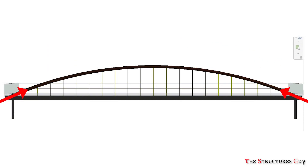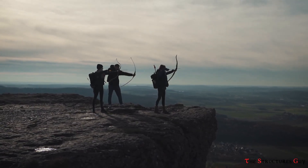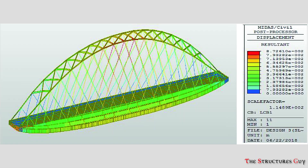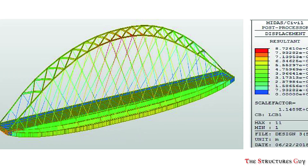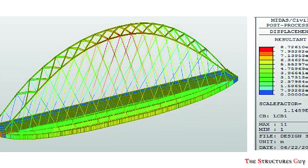The loading causes thrust in the arch, which is balanced by tension in the tie beam spanning the length of the bridge. You can think of this as a regular bow used for archery or hunting. The arch in either case will deform downward and will try to spread its feet, but this is limited by having to stretch the tie beam, or the string in the bow.